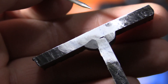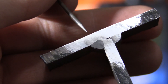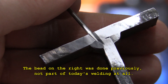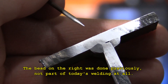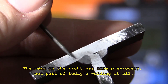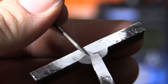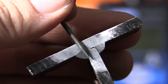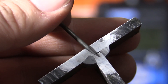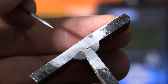To show how much difference it makes being able to get all the welder can put out — this is actually a 3/16 inch T-joint. In my previous testing with 3/16 inch T-joint I had almost complete lack of fusion with just barely the tiniest dabs of penetration and no penetration down into the root. By contrast, this joint shows no real lack of fusion. We have decent penetration on the lower section all the way down into the root, and you can see even right at the toe it was burning in. We have decent penetration on the vertical section as well — 3/16 inch material, 035 wire, CO2 gas, and actually fairly decent penetration.